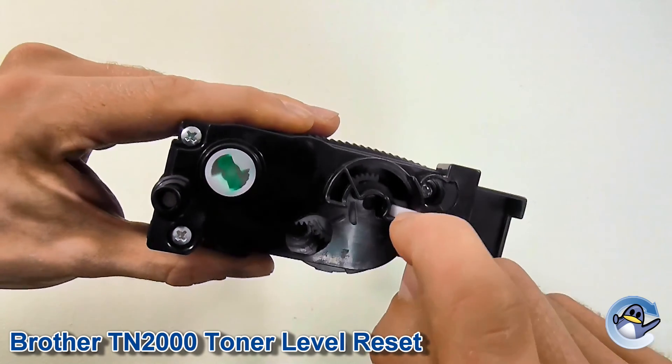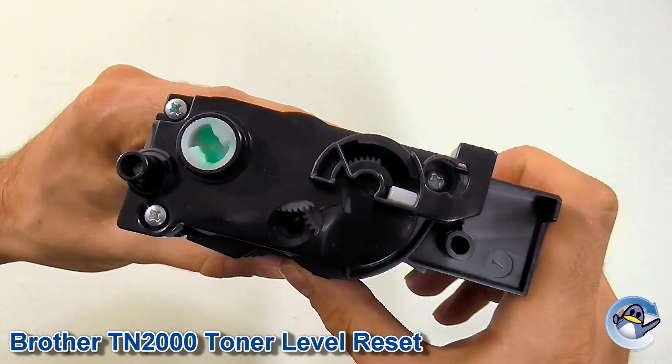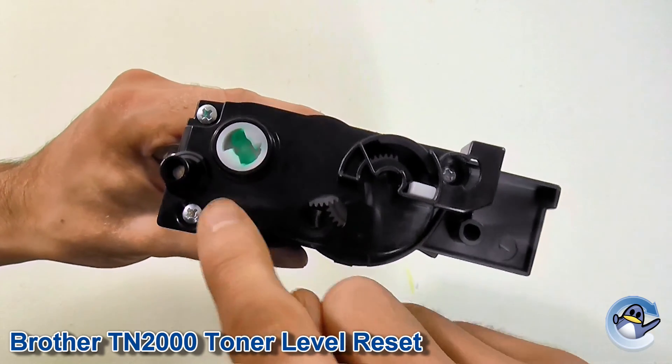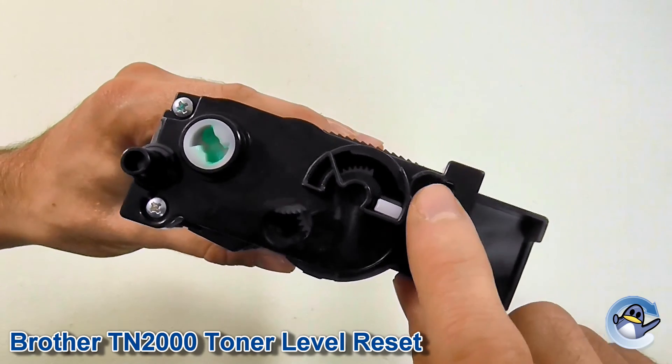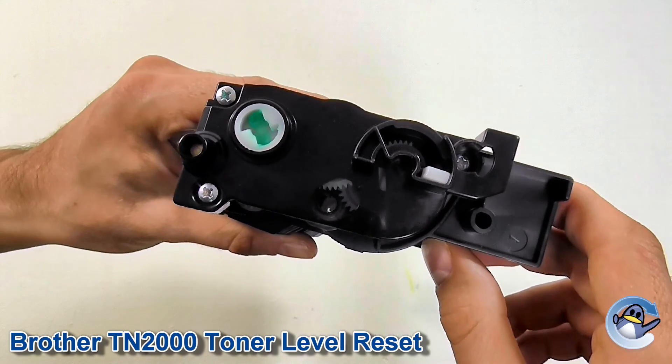Which is actually this little bit here. Now the first thing we're going to need to do is remove the three screws on the end of this. You can see there's one there, one there, one there. We're just going to remove these with a Phillips head screwdriver. I'd recommend taking that one out first and one of these ones out last, for a reason that will become evident shortly.